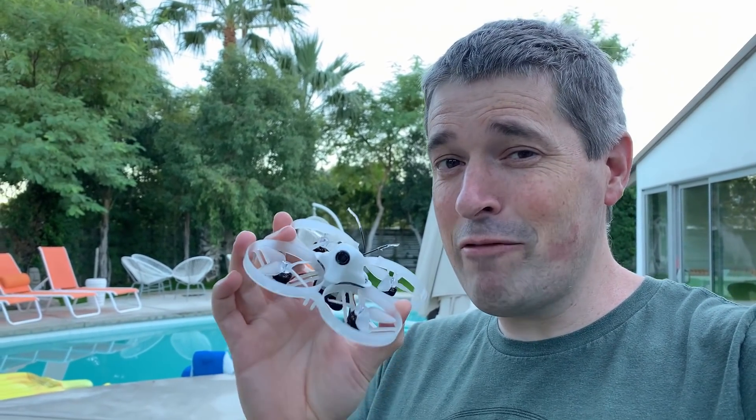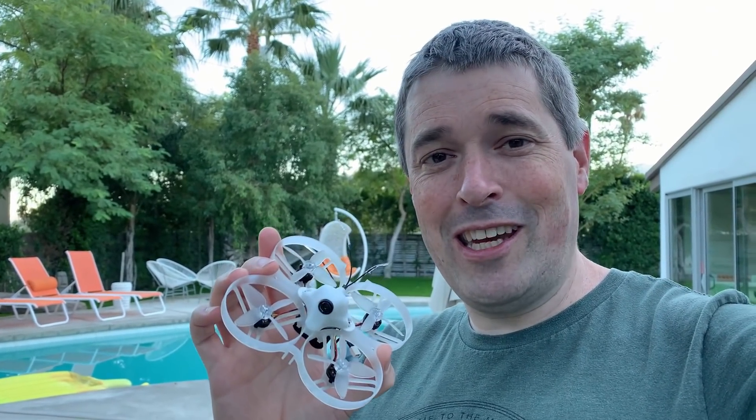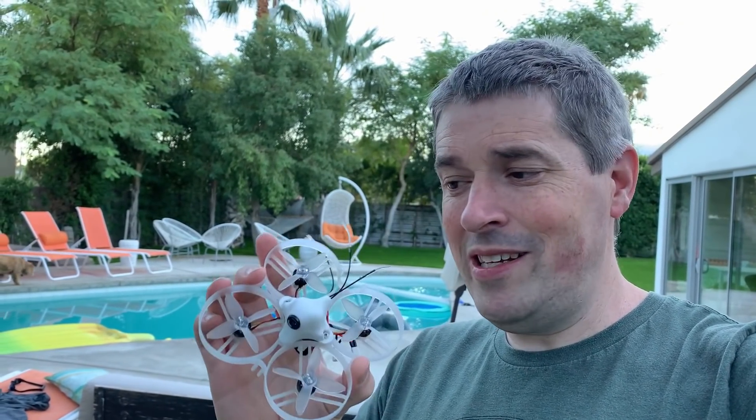This has been a really fun project and I'm happy with how it turned out — I think this was quite successful. This one is really waterproof. I can sit it in the water for a long time and still take off as many times as I want, and you can even see underwater which is super cool. The only real problem has been that front-left ESC. I really don't think that's water damage directly because it can sit in the water for quite a long time and still arm just fine. The problem happens when I try to troll through the water fighting against resistance — the ESC is actually overheating and malfunctioning, but if I let it sit for a while it works again. As far as corrosion, I have not seen any problems yet. The USB connector is doing fine, the power leads are doing fine, and most of the electronics are under silicone so they can't get corroded.